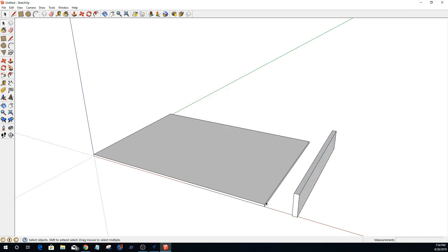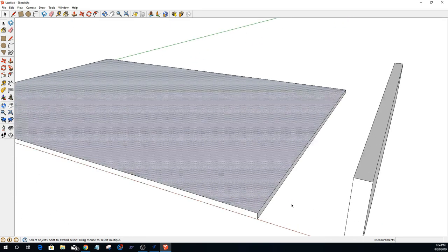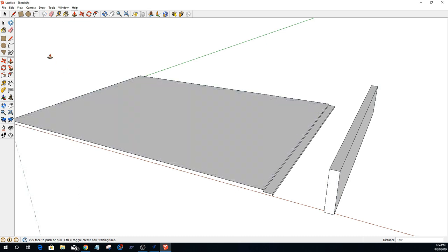G for component. All right, on my base here, because I am going to have a base of the box, even though the side frames where the Keurig K cups are going to go in the back area are going to be hollow, this front part is where all of my tea bags, Crystal Light packets, sugar packets, and everything are going to go. So we need to put a rabbet, by 0.25, and P for push, we're going to push this down 0.125. That's going to be the rabbet where this front piece is going to go.